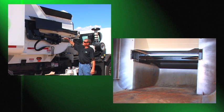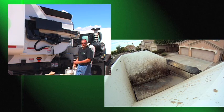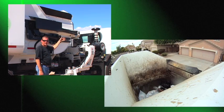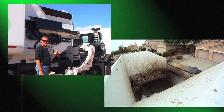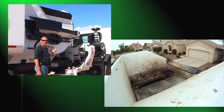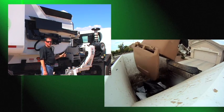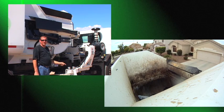The packer is elevated 36 inches off of the floor. It's in a horizontal position like a rear loader where the hopper is always covered, therefore it eliminates the need for a manual hopper cover, an air hopper cover, or a hydraulic hopper cover — the packer blade is your hopper cover. You actually have a tighter tolerance around the packer blade in the hopper covered position than any of the competitive equipment out there.